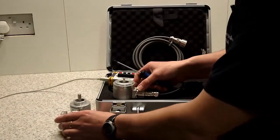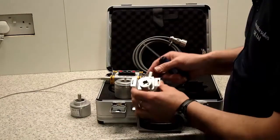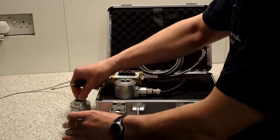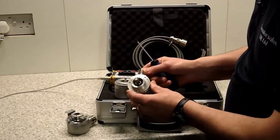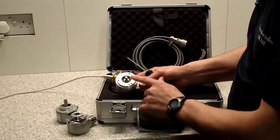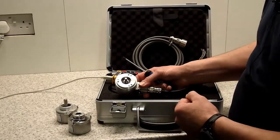The body styles we'll be stocking on the EIL 580P programmable are: the through hollow shaft with a 12mm hollow, the industry standard clamping flange with 10mm solid shaft, and the synchro flange with 6mm shaft — the one currently connected to the programming equipment. Those three body styles are quite common.